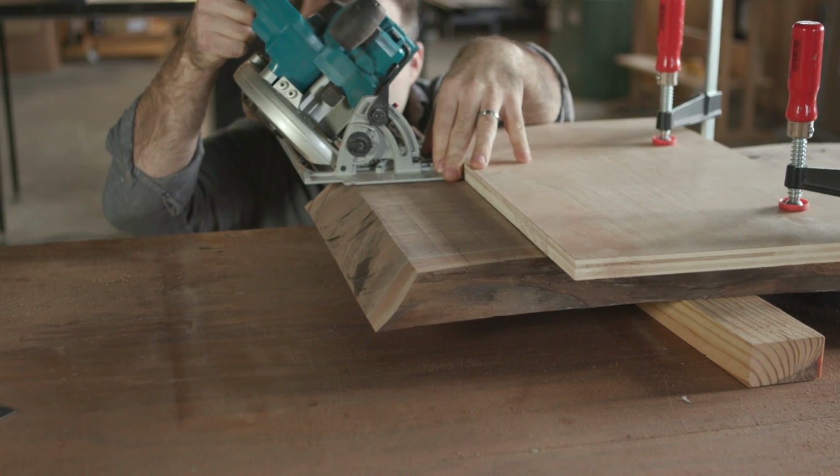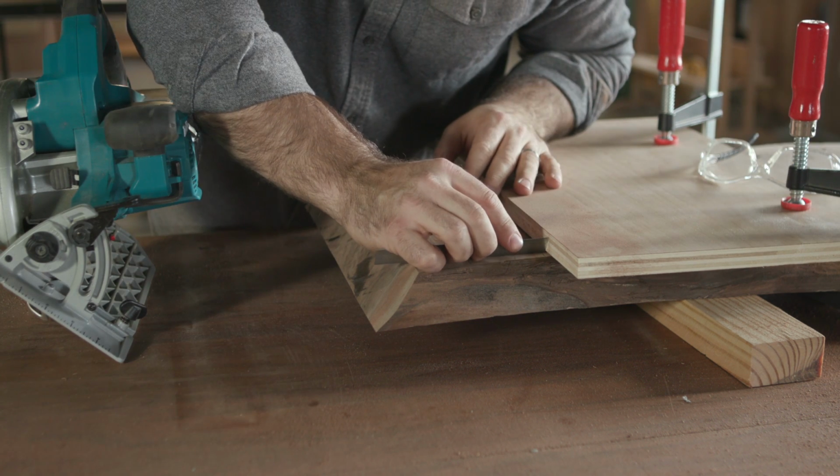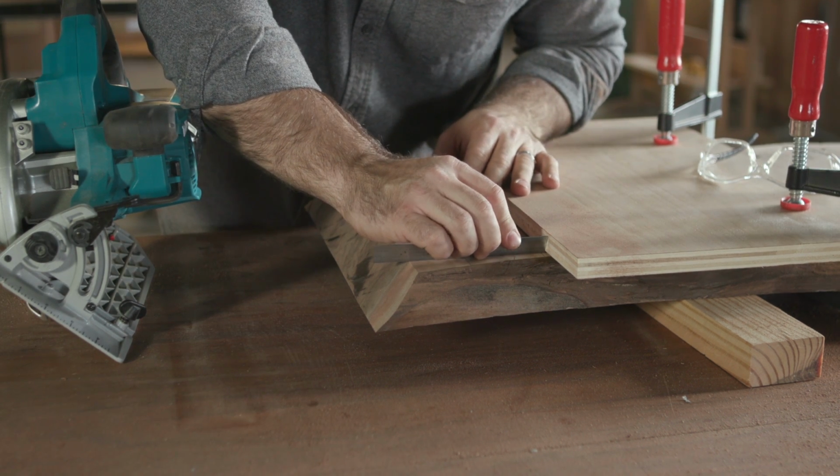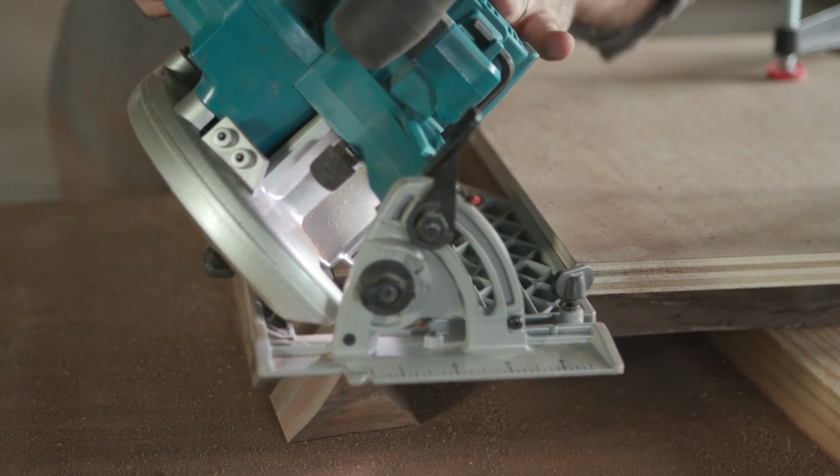With the first cut complete, the straight edge is moved to the second piece, marking a new line measuring from the opposite side of the base plate to the blade. And a mirror image of the first cut is made right at the location of the first cut.